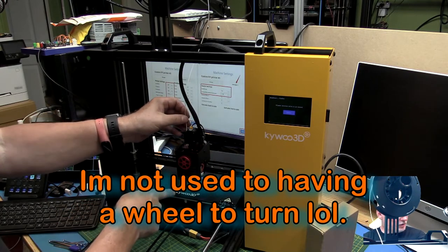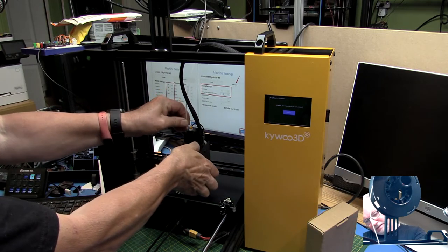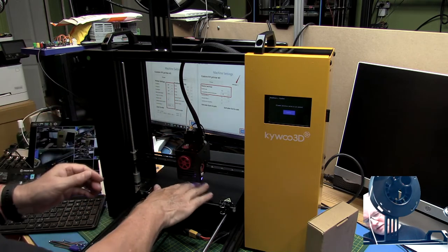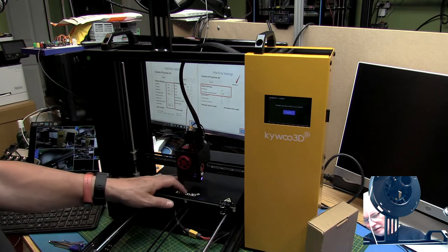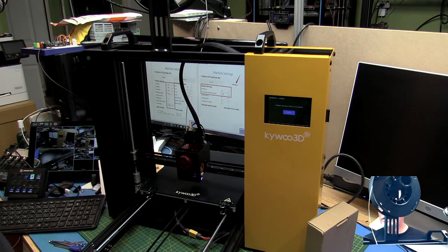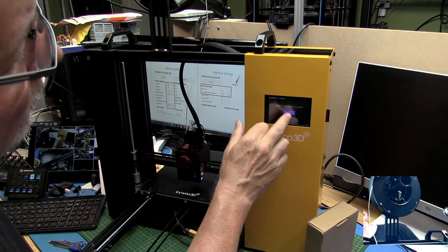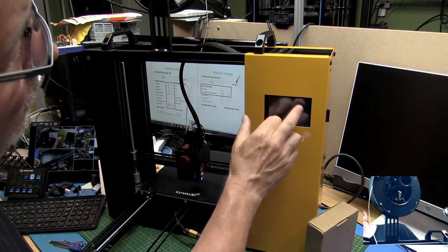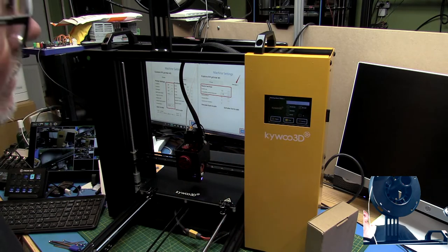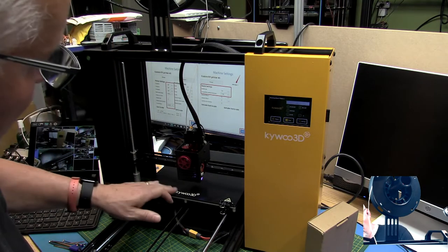And looks like it's printed orange before. There's a test print probably at the shop. There's our color coming through nicely. So okay, that's the filament loaded. Ooh, definitely sticks. All right, so we've got filament loaded. So let's pick ghost. Confirm. All right, that's now 210, waiting for the bed to get up to 55.